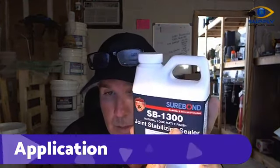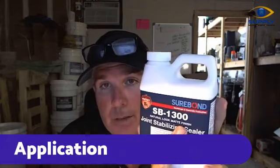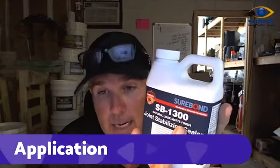Now, with a squeegee, you can remove that excess that's off of there. And 1300 is a single application product, so you don't have to do 2, 3, 4 coats. Now, you can do that, but realize that the more coats that you put down onto it, the more you're going to increase the sheen. And the idea is to give it a matte finish. See right here, matte finish. So if you start stacking up the mils on top of it, it can get slippery. So you've got to be careful with that so that it doesn't do that.